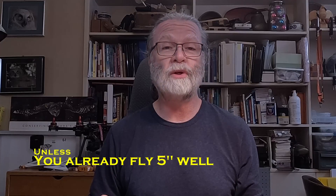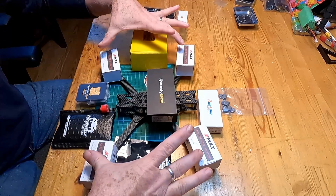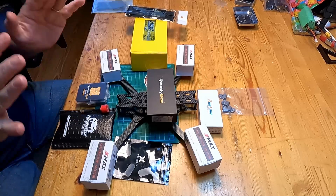If this is your very first time building a quadcopter, 7-inch quadcopters are not the place to start. You should switch to a 5-inch quadcopter build. There will only be two things you need to change: the motors and the frame. Everything else can stay the same, and once we get into the actual building, I'll explain exactly which ones to get and why.